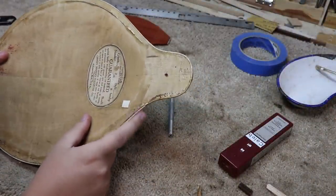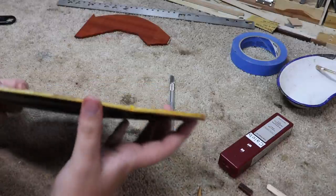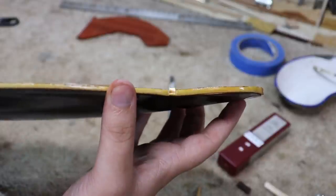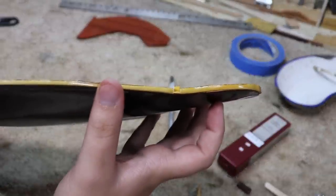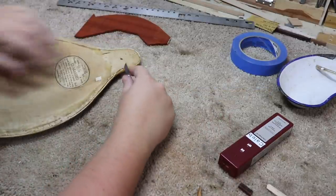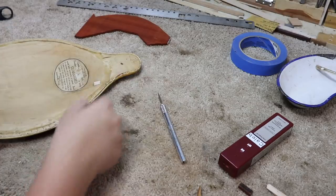It's good and safe. Well, right where this break was, this binding had come off, and then there was a missing piece, and I've gone ahead and found another piece that was pretty close. Bring it up. Let it focus. It doesn't fit exactly. It needs a little bit of scraping, and then it is a little tall on this side too, but that's okay. I can scrape that back down. I think you won't really notice. Anyway, I'm just gonna probably scrape it down with this X-Acto knife. Get it sitting flush, and I think it'll look pretty good.